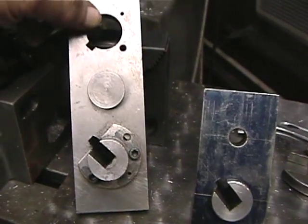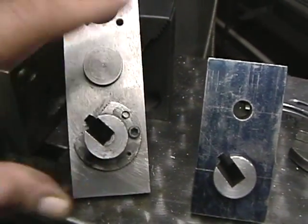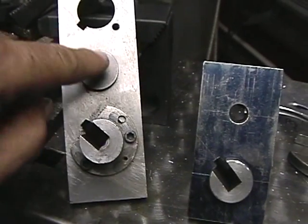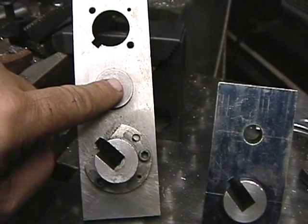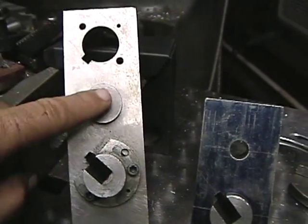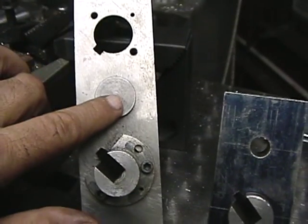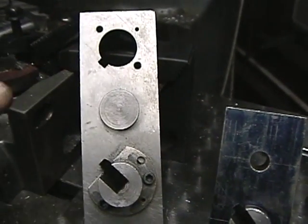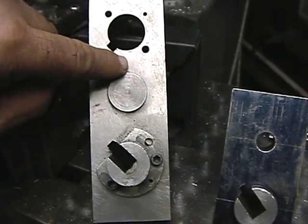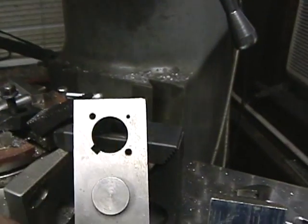What I usually do is machine the drivers with the center hole, then set them up on the mill and indicate that hole. I bore this hole on all of the wheels — take one out, put one in — and just continue to bore them each one separately. I generally center drill them in the machine, take them over to the drill press, drill a rough hole, then bring them all back and carefully bore each one out. I usually put a layout line across the crank pin lobe and indicate that off the back of the mill to line it up.